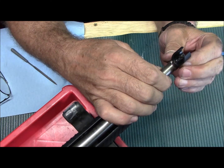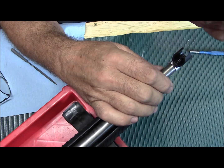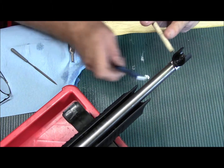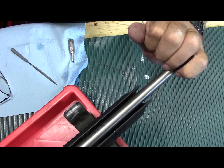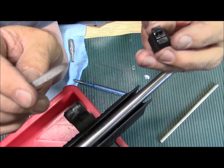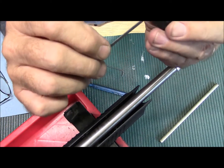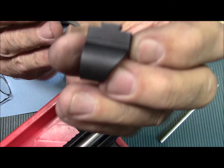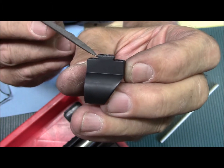And this goes about 2/3 of the way, and then it wants to stop. Get yourself a piece of 1/4 inch wood dowel. Tap it back out. And take a little file. You can use one of these little needle files. You can use a piece of folded up sandpaper or even a nail file and just file a tiny bit off the tops of the corners of the dovetail. This way you can take a little bit off until you get the right fit.